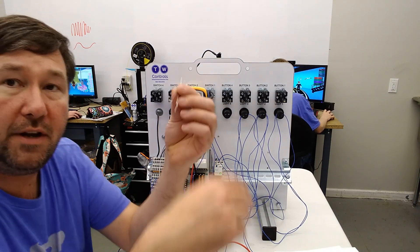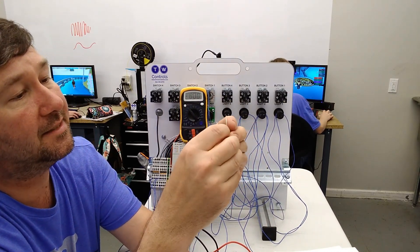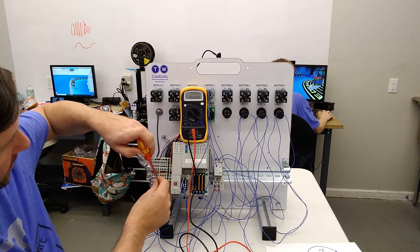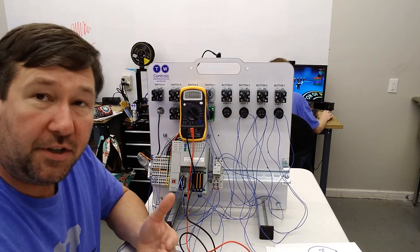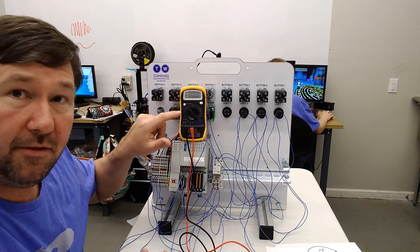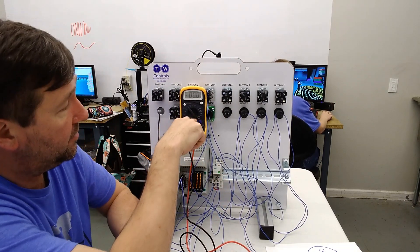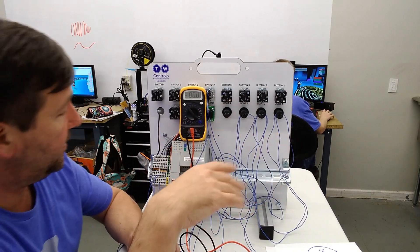I have three 100-ohm resistors to replace our lights, and we're going to start off with just one of them. I'm going to put it on to the plus 24 volt of our power supply and we're going to measure the amps with our meter. I have a video that shows how to measure amps — I'll put it in the description. In this case we'll want to use the 10-amp setting, not the milliamp setting. You will blow the fuse in your meter if you use the wrong setting here.